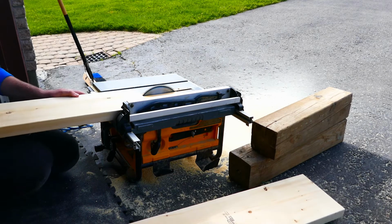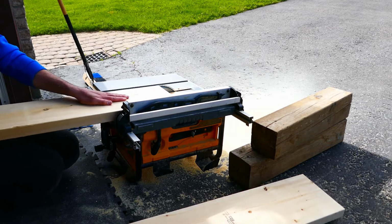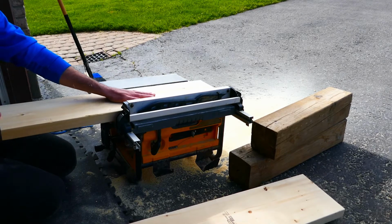However, I only took a 1/4 inch off one side, knowing I'd be using a 3/8 round over bit on the edges once it was all glued together. That would hide any of the uneven rounded edges that came with the lumber.